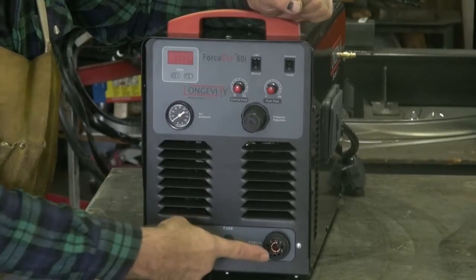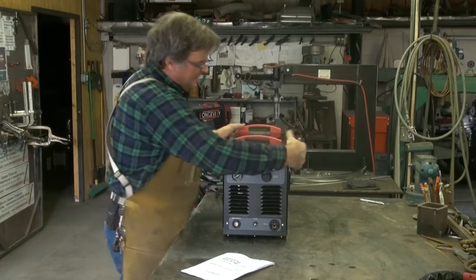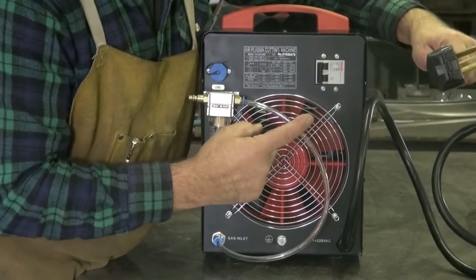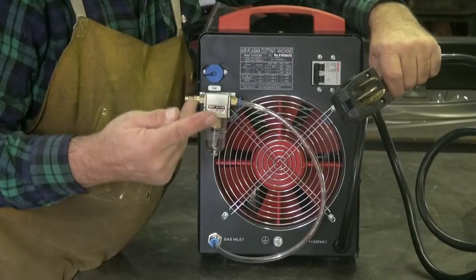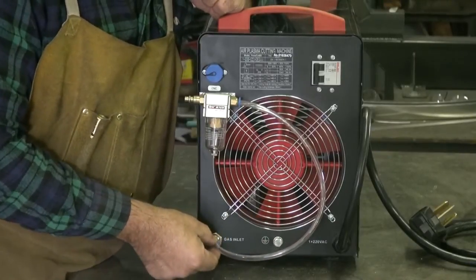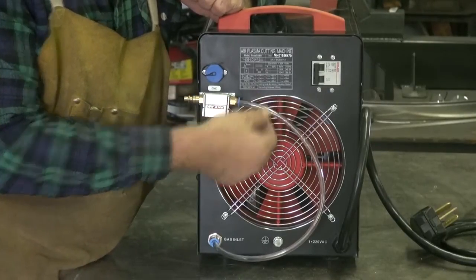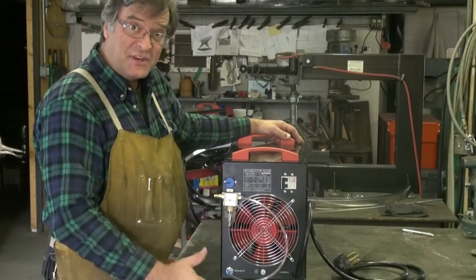And your hookups for your ground and for the torch. Let me swing it around and show you the back of it and show you how to hook up what's back there. Of course, your power cable — it's a standard 220-volt single phase, so there's just three wires in there: a black, a white, and a green. Standard hookup, whatever works in your shop. You get this air connection hose that goes into the machine with a little press-in fitting. You get this little water separator and a little bracket for it with the screws. Air hose slides in on this side, your hose from your air compressor just clips on the other side. So that's it — you hook this up, you're good to go. Get to work.